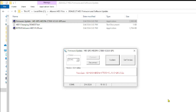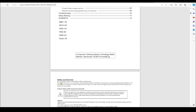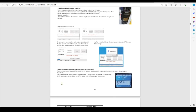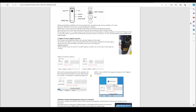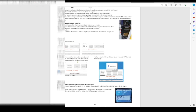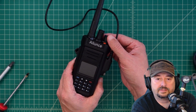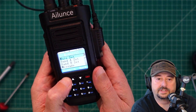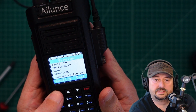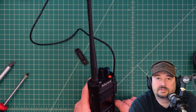The next thing I'm going to do is show you something. Here's the user manual — I'll include a link in the description below. If I scroll down to about page 9, there's a section on updating the firmware operation. There are instructions for doing this — I just didn't know about it, and this is where I got the information about entering DFU mode. Let's check the radio: turning it off to exit DFU mode and back on. Going into the version information, you can see it says version 2.0.0 — it worked! If you have any questions, comments, suggestions, or recommendations, go ahead and post them below and I'll do my best to respond.